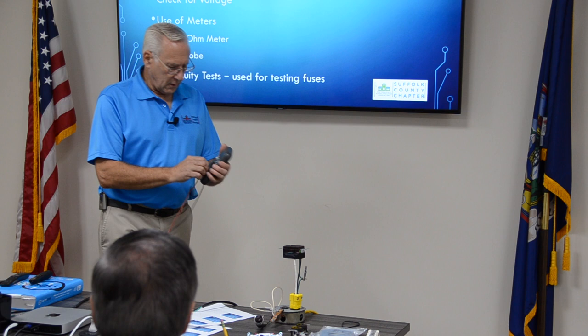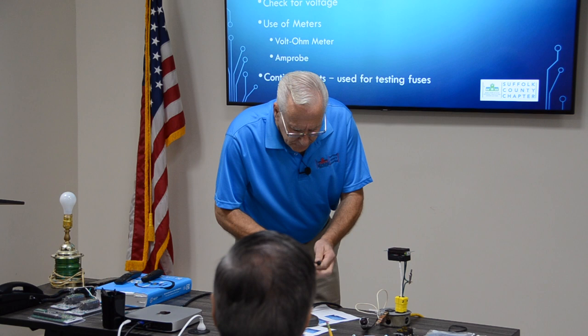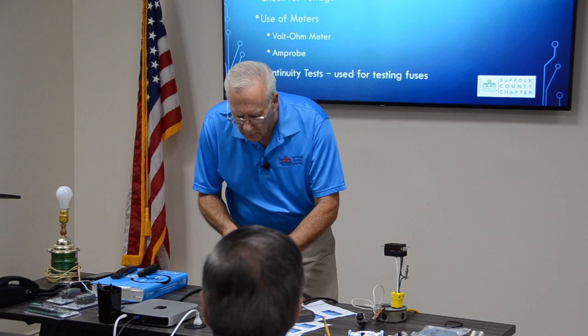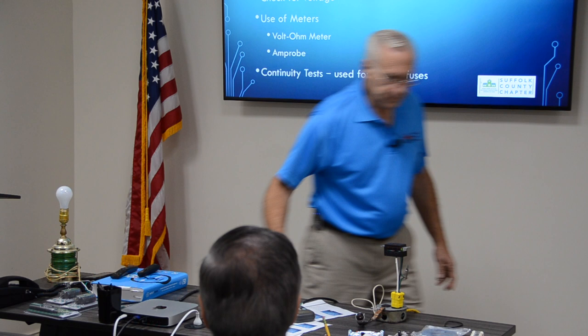Voltage AC, DC, and it has continuity. We'll go over the continuity. On touch of two, this is for continuity testing. You hear the beep? So if you wanted to test to make sure that something is good, you know, here it's not going to go, things like that. Continuity. Fuses. If you were checking a fuse, pull it out before you test it, you make sure that it's dead.